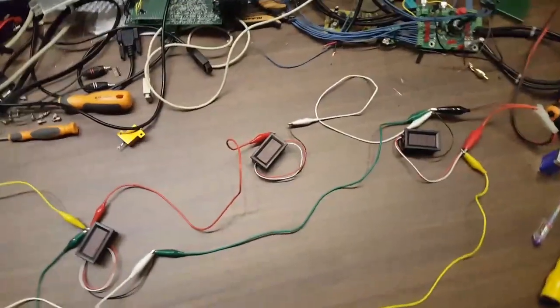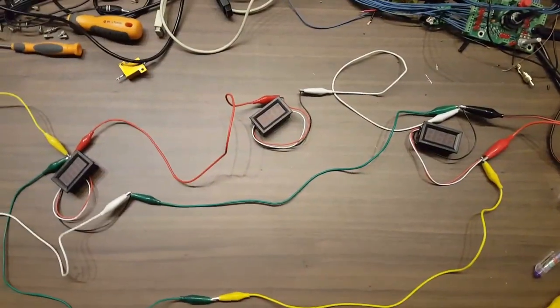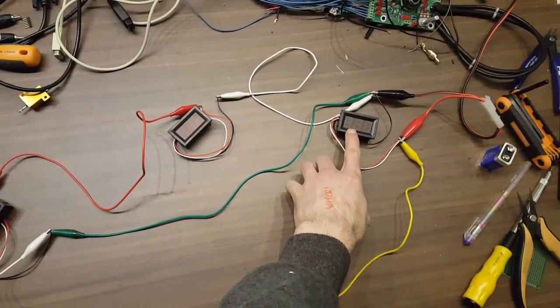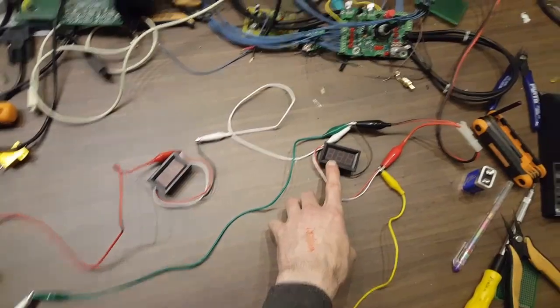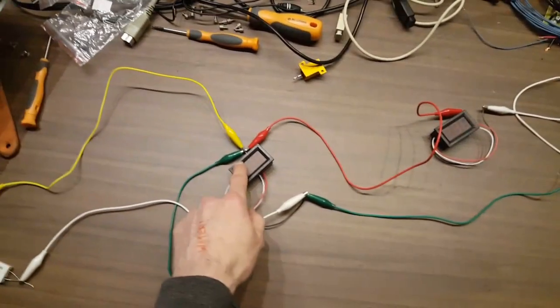This is why you want to ground your voltmeter to the amplifier you're measuring the voltage of. This gauge here is basically the battery supply, connected straight across from the bench supply. This gauge here is measuring at the load, which is here, not connected.